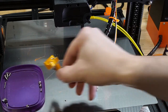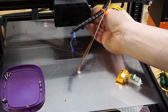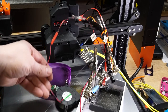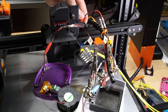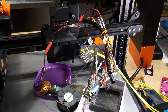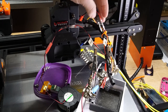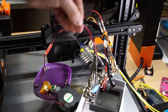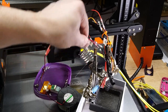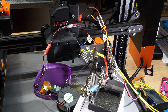That is done. I do have a new BL Touch mount that will go on this once I get all this put away. The front fan connector to the rear fan had a JST connector, and getting those pins out and putting them back in was a real challenge — embarrassingly about an hour and a half process. These are 26 to 24 gauge wire, so I'm comfortable using heat shrink tubing connectors, though you have to be careful how much heat you apply on such thin wire. The thermistor wire has the connector so I can connect it over, and the only thing I have left now is the heater connection.